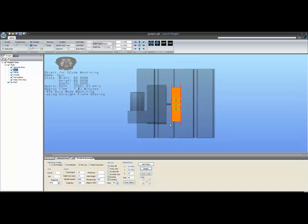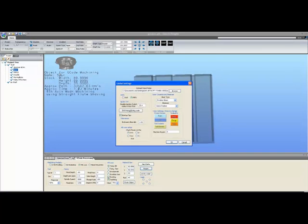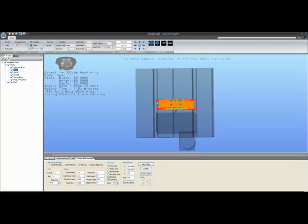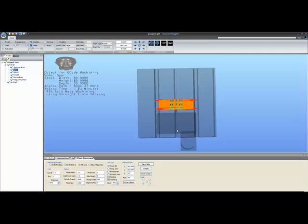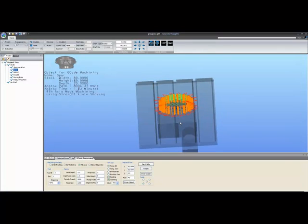I realize that some of you do not have a system where it is in that orientation, and if we go up to the options again, you will see a 4th axis setup with selections for which axis your chuck on the 4th axis is pointing along. For example, if I was to select Y+ and then do a regen of the system, you'll see now that the 4th axis is at the bottom of my screen, and the gear is being cut in the Y+ direction. These settings are all necessary, of course, so that you can get the proper G code out for your machine.